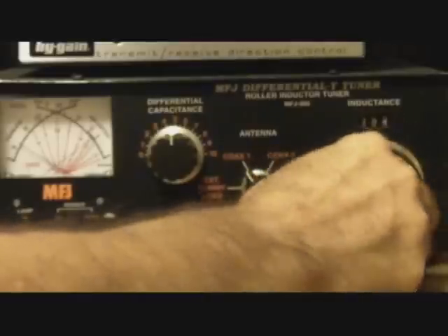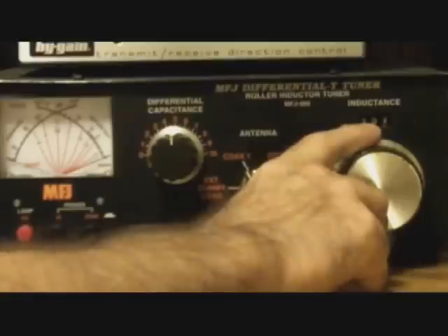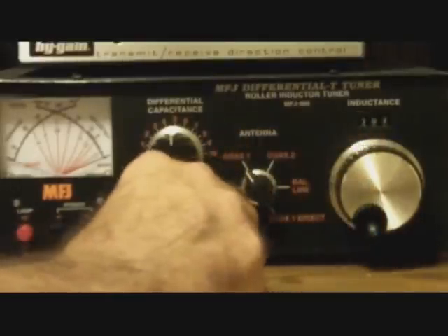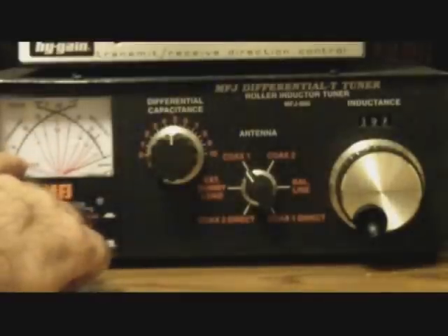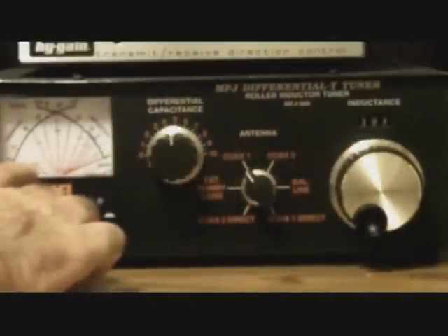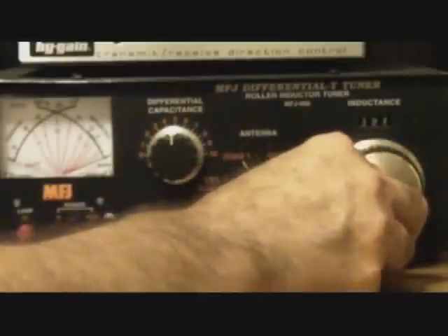The first thing I usually do is start with the inductance knob on this particular tuner. Let's see if we can lower the SWR — I'm keying it up... And it dropped way down to virtually zero! I'm looking at my analog meter up here — it says 157, and according to my piece of paper, I've got 157 written down. The next thing I try to do is get as much forward power out as I can, which takes a gentle touch going between the two knobs while making sure the reflected power doesn't go up.